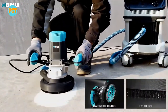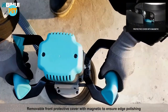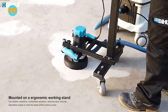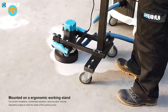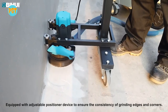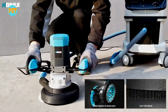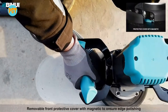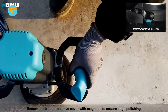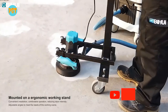It is made of durable aluminum alloy metal and engineering nylon. It has a removable front protective cover with magnetic convenience for corner grinding. Bihui has designed it with overload protection and a speed regulator so you can adjust the rotation speed. Its built-in self-cleaning design equipped with a professional vacuum cleaner creates a smarter, healthier work environment. It can be used on tiles, concrete, tile adhesive, natural stone, plaster, paint coating, and adhesive. Priced from 319 pounds.